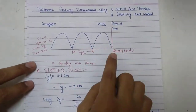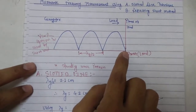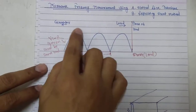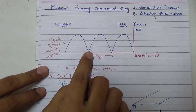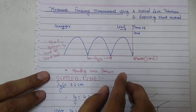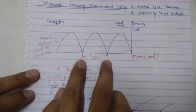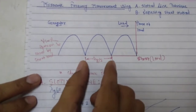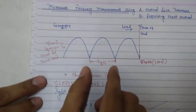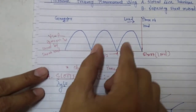With a short connected at the load, at the short we have a zero location or minima point for the VSWR, and as you move from the load towards the generator you will find alternating maxima and minima all the way to the generator. The distance between two adjacent minimas will be λg/2. Since the wave is inside the waveguide we call that wavelength the guide wavelength λg. We prefer to measure the distance between adjacent minimas because those minimas are sharply defined compared to the maximas.